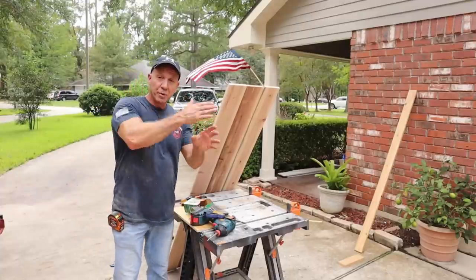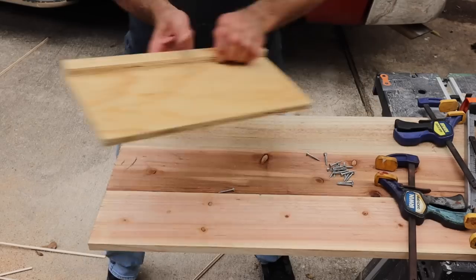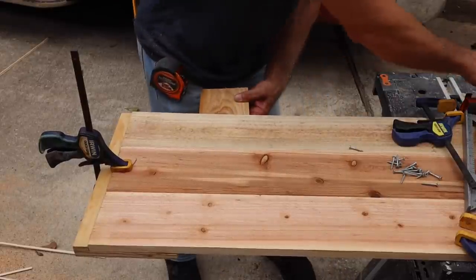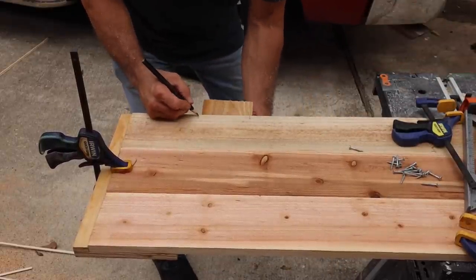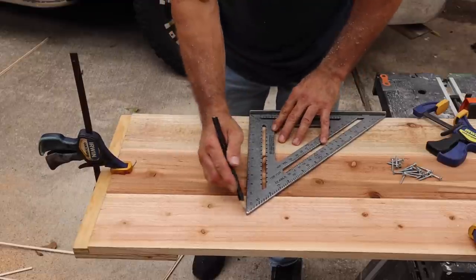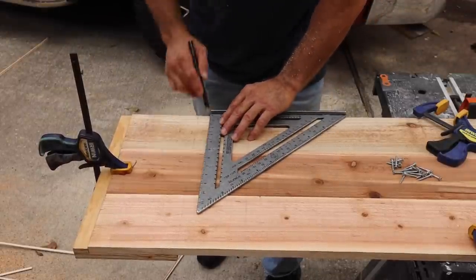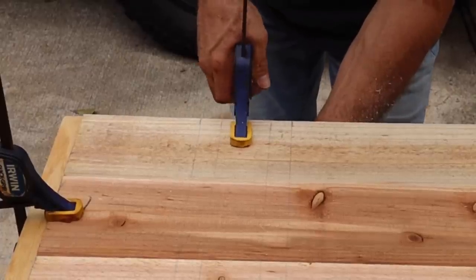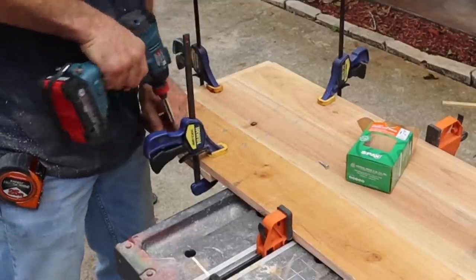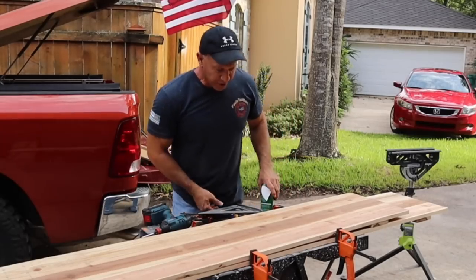These are 73 inches long, so I'm going to put three slats in between cross members. We'll get the first two and then work the third one. These screws are exterior screws. Don't go right on the edge — go at least three-quarters to one inch off the edge. You don't want to split that wood. We want to get the center of this board because we're going to put our middle board in.